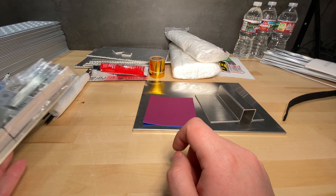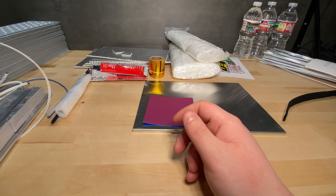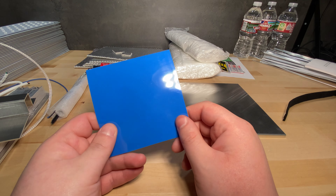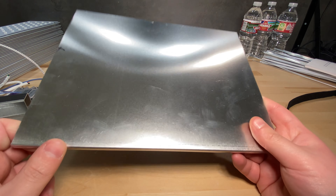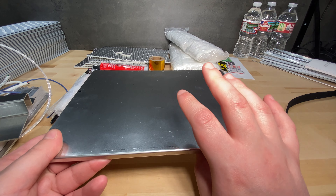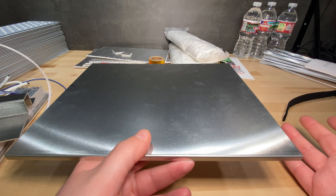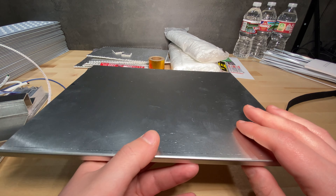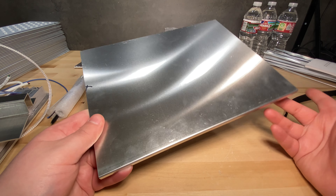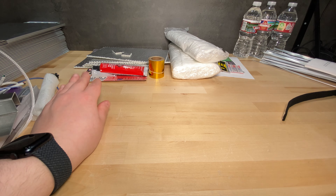You also get this C-shaped aluminum plate, which might be the heatsink — we'll see when we assemble it. There's also what feels like a thermal pad, again presumably for heatsinking the SSRs. This is the PCB tray, which is one of the most important parts. You need something that transfers heat efficiently when you place the PCB in here for the reflow. This is aluminum, which distributes heat much better than steel. This is also a very specific thickness according to their documentation, as apparently this thickness works best. They also recommend buying extra ones.